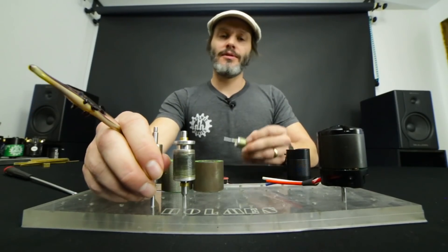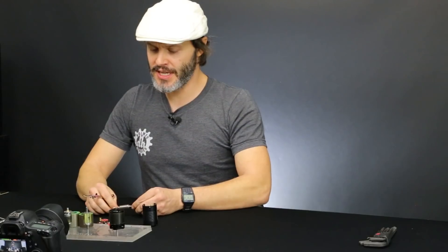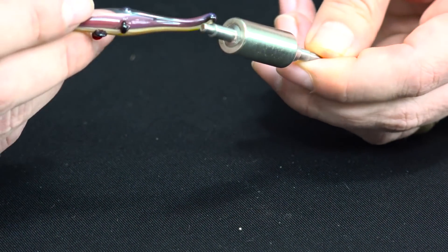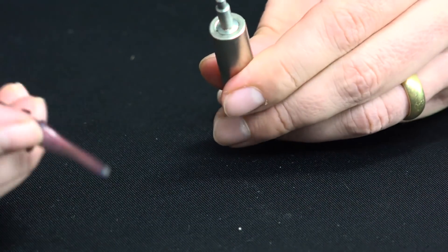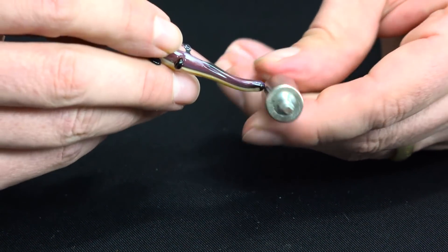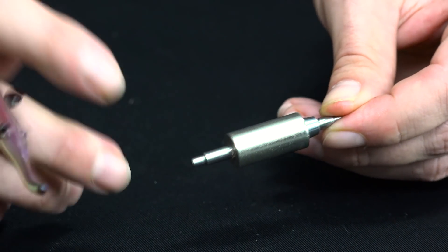We also have an example of a two pole motor here. As you can see, this is one solid magnet, just on the shaft. Since it's one solid magnet, we don't always have a stator or laminations on the inside to affix it. But it's still a rotor — it still has a magnet affixed to a shaft.